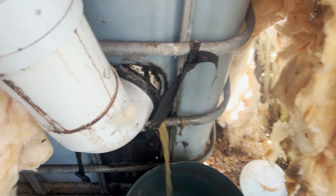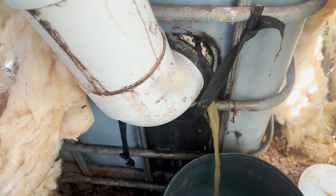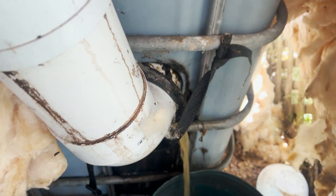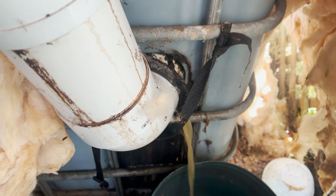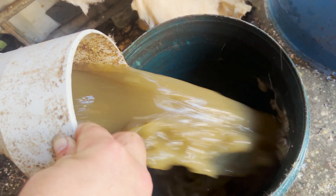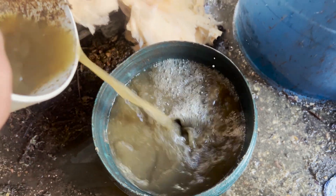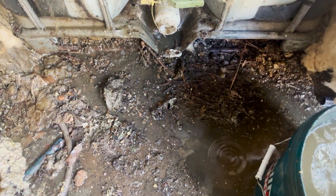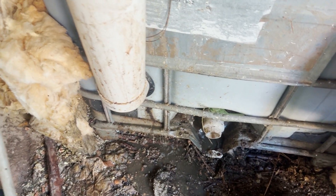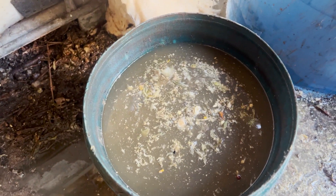I think over time the silicone around the fittings just wore out, so I did a slight turn to try and drain through the outlet nozzle, but it gave way — that's how I'm emptying it now, and it's nearly down to level. This is a bit gross — emptying from the front now. I had a bit of a blowout and got crap everywhere, with little chunks of food that haven't been processed — little floaties. I've always said if you're into biogas, don't be squeamish and don't expect it to be mess-free.